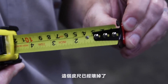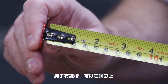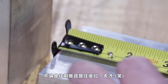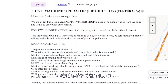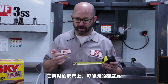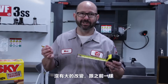Tape measures are only slightly better, but they're really useful as machinists when rough cutting material. Right off the bat, I might think this tape measure is broken — the end is all wobbly. But it's not broken. The end hook on a tape measure is supposed to move. The hook is slotted so it can slide on its rivets forward and back by the width of the hook, allowing accurate measurements while either pushing or pulling. Genius! Every machinist needs to know this. Accurate measurements start with knowing your tools. On an inch tape measure, the graduations come every 1/16th of an inch — 1 divided by 16 is 0.0625, or 62 and a half thou. For metric tape measures, the graduations are still every millimeter.